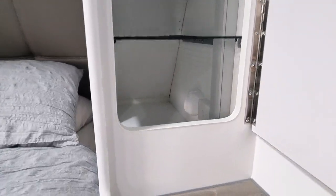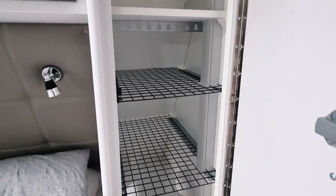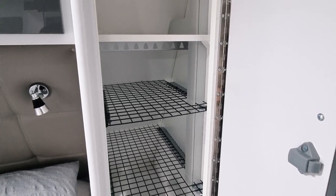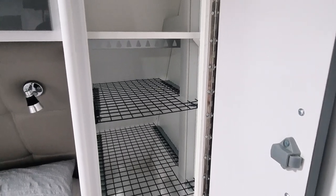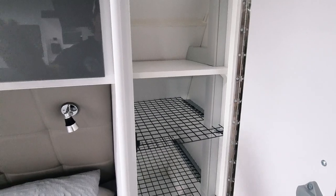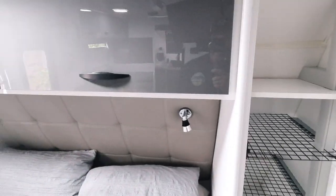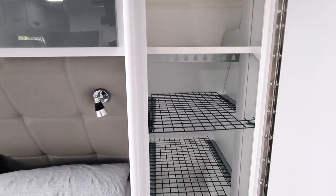As you can see, I have put some shelves in there now. The first thing you think is you want to put some shelves in the cupboard and you think MDF — but the thing about MDF is it's pretty heavy material, so you don't really want to add more heavy material to your caravan. I really wanted something lightweight and strong. Another problem with these cupboards is they're facing the outside, so the sun heats up all these cupboards, especially the ones up here above your bed head.